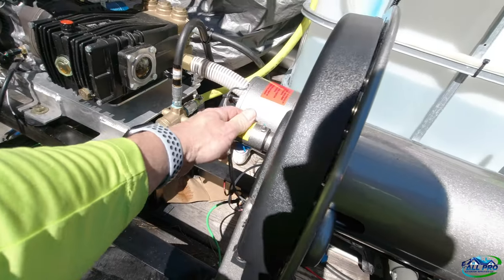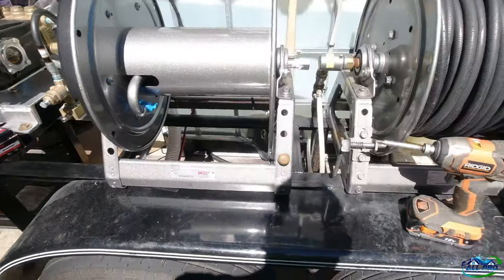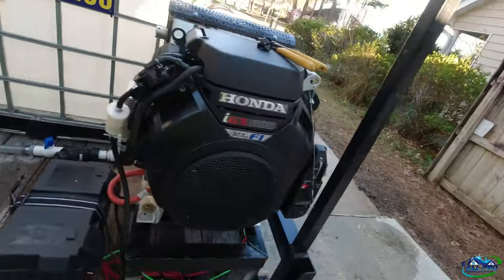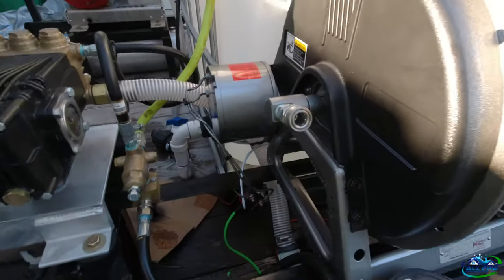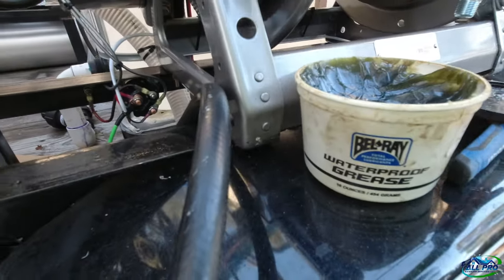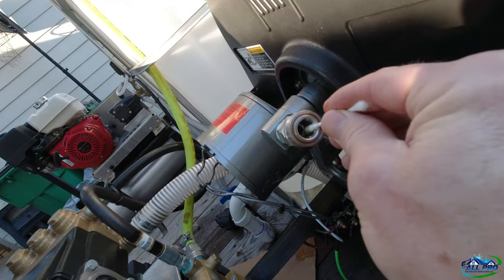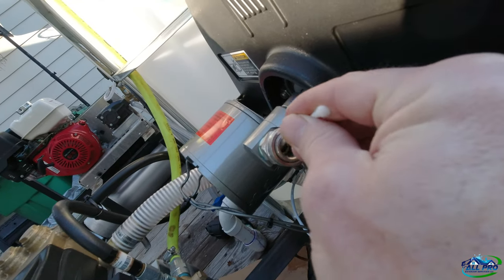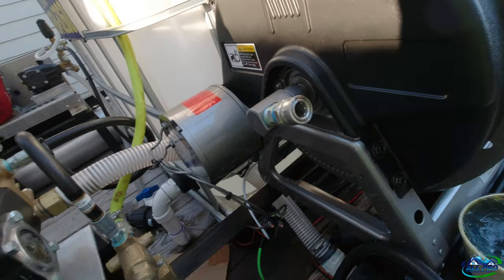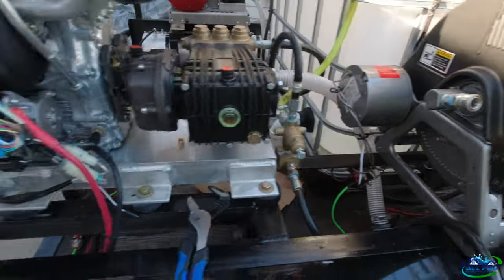On the feed I'll use a quick connect on my jumper hose from the unloader block to right here. Everything's mounted — thing's a beast. Got the hose on it, just hooking up my jump line. One little thing I do — I take a little Q-tip with marine grease or waterproof grease and run it inside my coupler here, put a coat of grease on it. It helps getting it off later. Put some on this side as well before I put it in. Going to put the ball valve on and we're done.